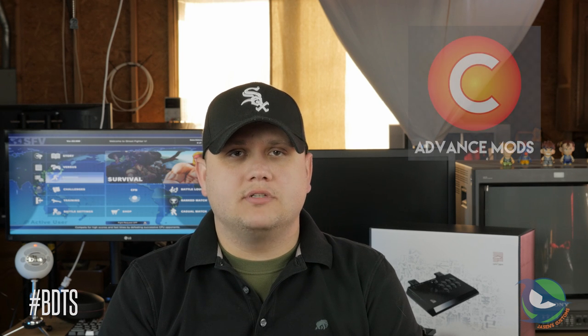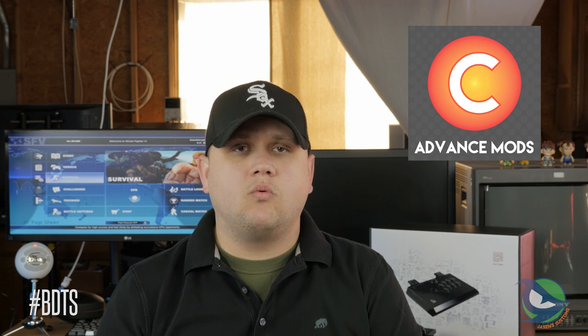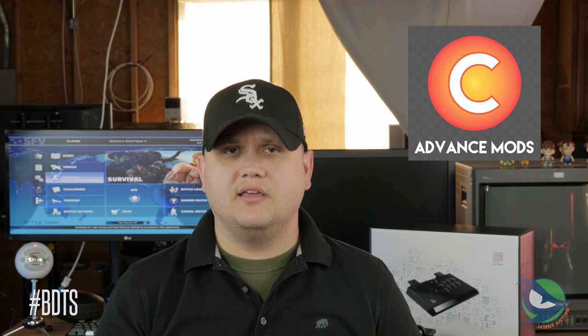The nice thing about this stick is the PCB is very user-friendly. Qanba did an excellent job of labeling everything so you can quickly and easily get to the points you need for soldering. Unlike the Drone, the Qanba Carbon has test pads or test points on the PCB for your Home, Select, Start, Turbo, Menu, etc. So you can solder some fine thin wire — maybe 26 or 28 gauge — and run that to an auxiliary board like a Brook Universal Fight Board if you wanted to quad mod this. The stick isn't exactly the biggest inside, but for advanced modders I would say this is probably a B or C level stick. You can easily get to all the stuff you need under those dome switches without worrying about affecting the operation and fit of the stick overall.